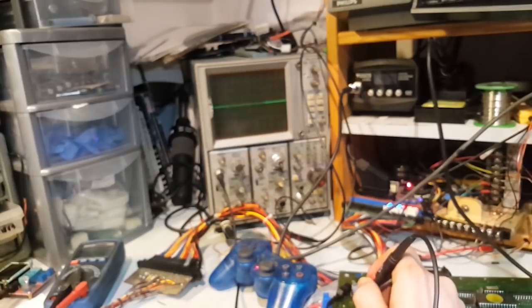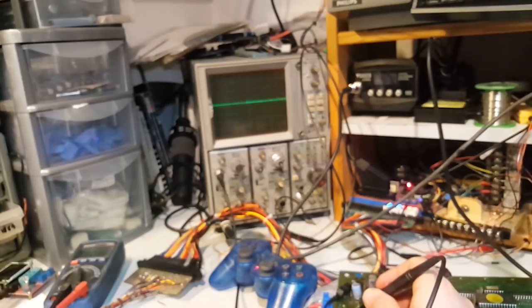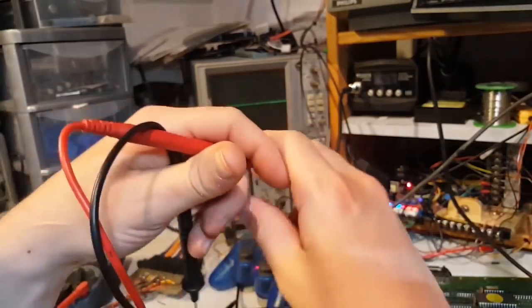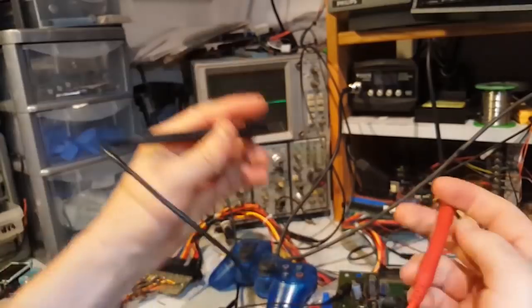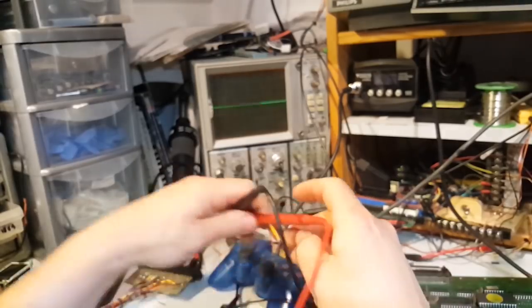So I'd say we have a short in this chip. Well, it could be a number of things. There's a short in the pull-up resistor, although it doesn't quite make sense. If it was a short, it'd be shorted to high all the time, and we wouldn't be able to fire. So I'd say we were short to ground, which is this pin, which we can check very quickly. I shouldn't do that with the power on, but there you go. Pin 6, there you go, no short. Pin 2 very short, pin 6 no short, pin 2 very short.